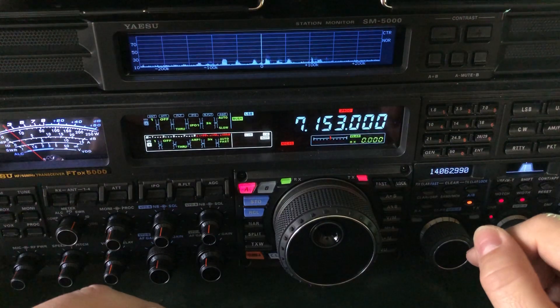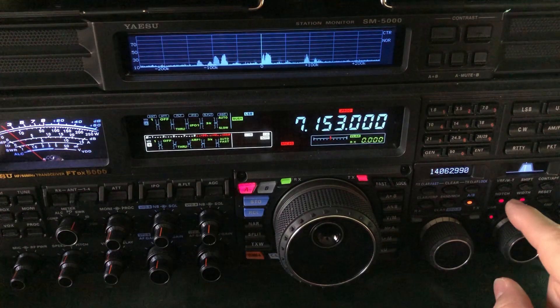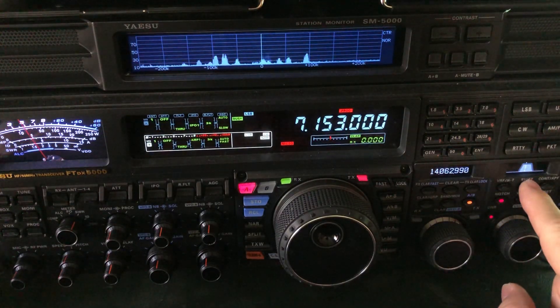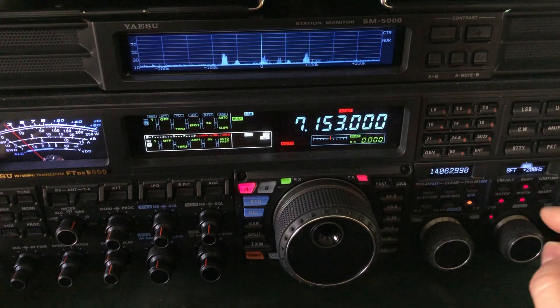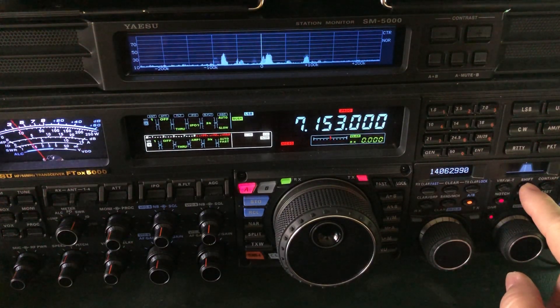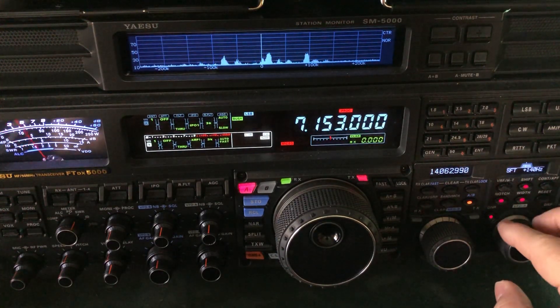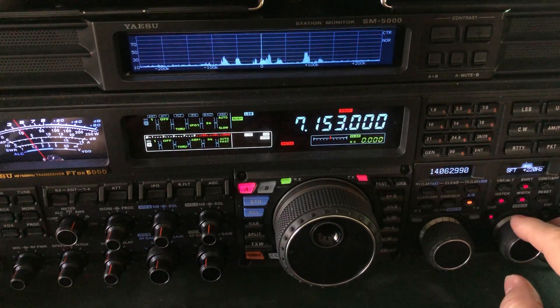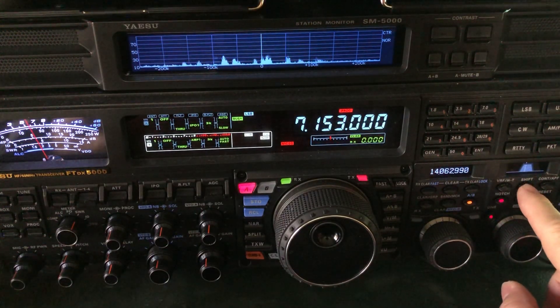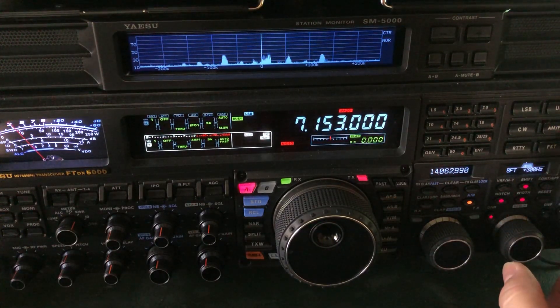Here we are dealing with something 2 kilohertz away. Remember the rule of thumb I gave you in the previous video — ways to combat this. Shift. If the noise is a low pitch, like that lower honking sound, use shift and go positive. Now, it's going to thin out the audio of who you're listening to, but it should also help minimize some of that honking you're hearing.